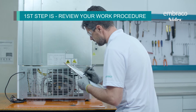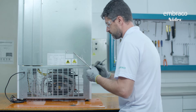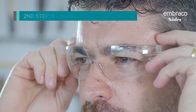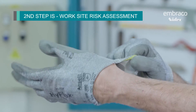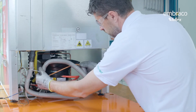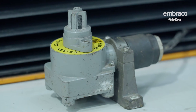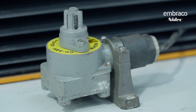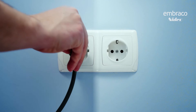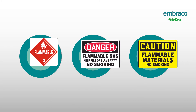The first step is to review your work procedure. We want a standardized work procedure used on every single job site, treating every site as if it has a flammable refrigerant in the cabinet. This includes a visual site inspection, donning your PPE such as glasses and gloves, looking for potential sparking components like pilot lights and switches, sweeping the site with your hydrocarbon gas detector inside and outside the cabinet, and leaving the detector running in the lowest area of the site since R290 is heavier than air. Next, unplug the unit and place the safety placard up.